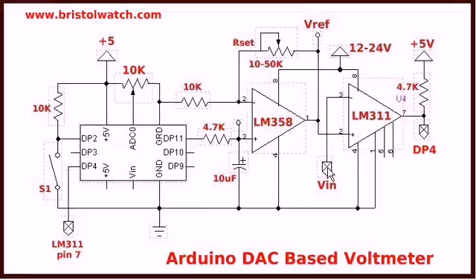V in is the voltage that I'm checking. Pin 7 is tied into the same circuit as before with the LED lighting up. As you see, the output feeds back to digital pin 4. As Arduino automatically raises the output voltage on V reference, it's checking pin 7 on the output for a low, and when I finally get a low, the count stops — and that's where I know the match between V reference and V in has occurred.